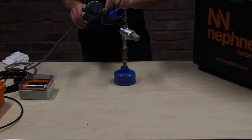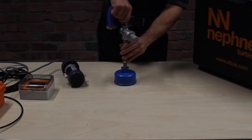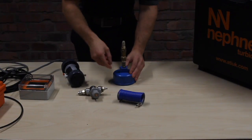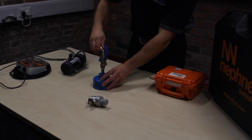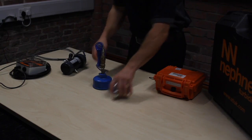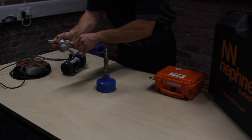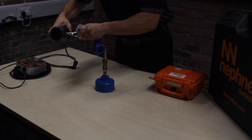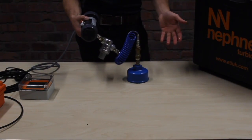Now, I am making the assumption that you have plenty of room in the hydrant chamber. In reality, you probably haven't. So, in that situation, take it away. And if so, we can start with the pressure reducer, the non-return valve. And then, if you want, connect your hose. And then if you need your pressure reducing valve, that connects in and secures to the flow cell like so. Okay, so ideally that's all you need to do.